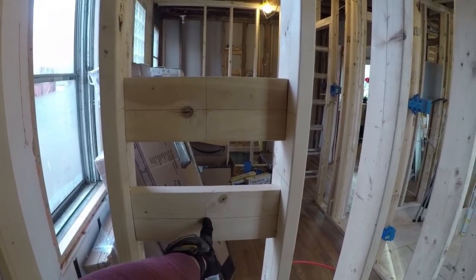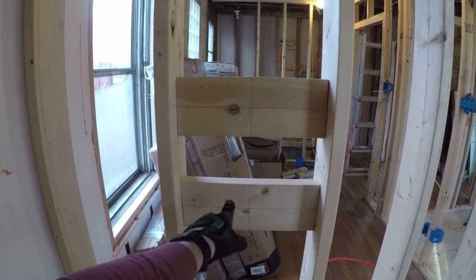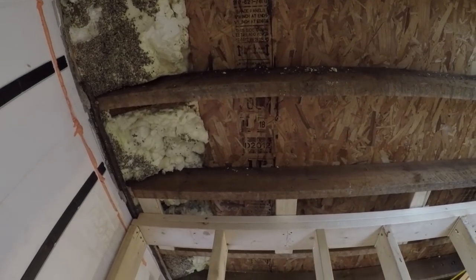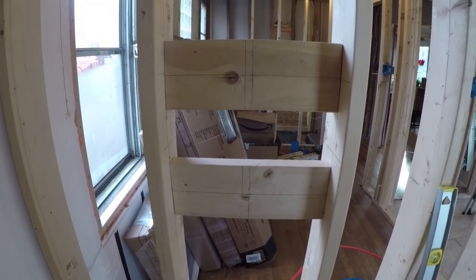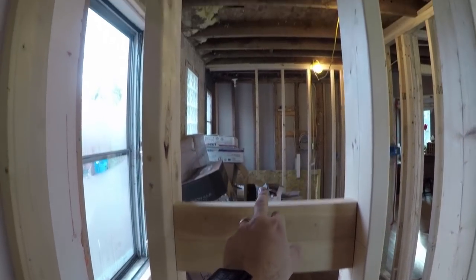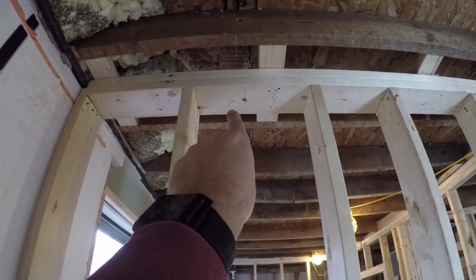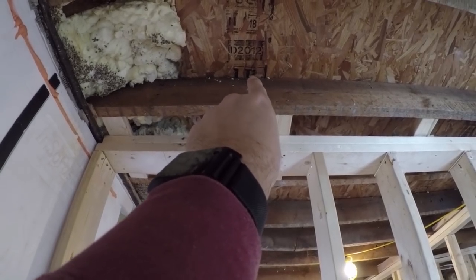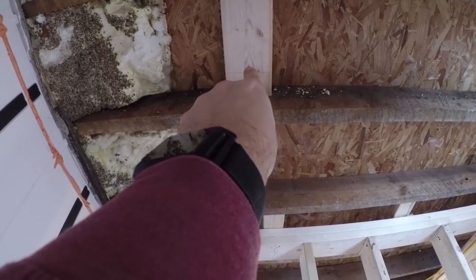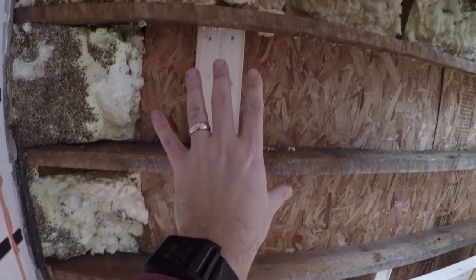You can see I'll center one valve here, the diverter here — hot comes up from the left, cold comes up from the right, and everything goes out through the top. We've got the supports mounted here and here, center points for both of those, and then we've got the hole drilled for the top for the rain shower, which will go through that joist, through that joist, and then mount right there on that support and drop through the sheetrock, ending right in the center of the room.